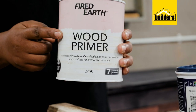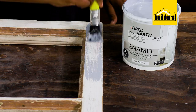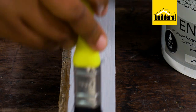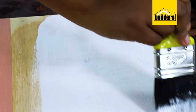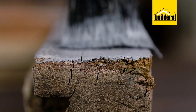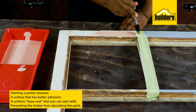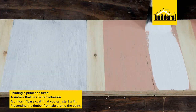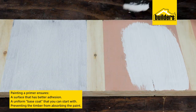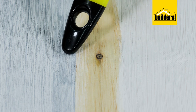Painting timber without a primer is not a good idea. As paint is drying, different parts of the timber are absorbing paint at different speeds. A sheet of wood does not have the same porosity throughout over the different grain structures. Painting a primer ensures you have a surface that firstly has better adhesion, but also a uniform base coat that you can start with. A primer also prevents the timber from sucking or absorbing the paint, which means we can get a better finish with less paint.